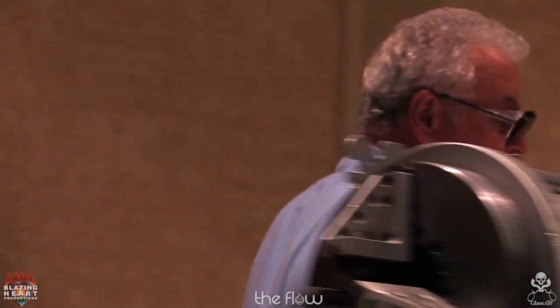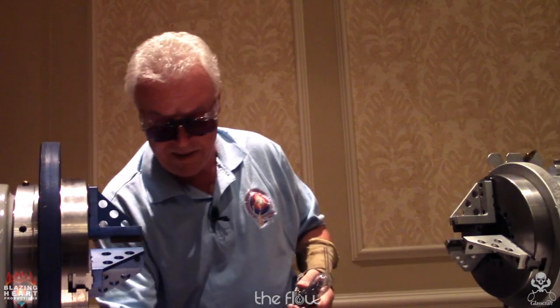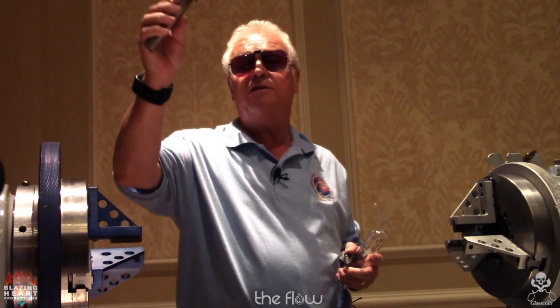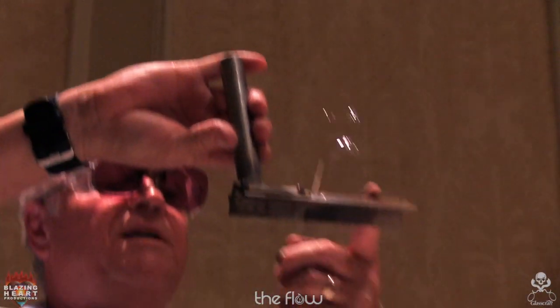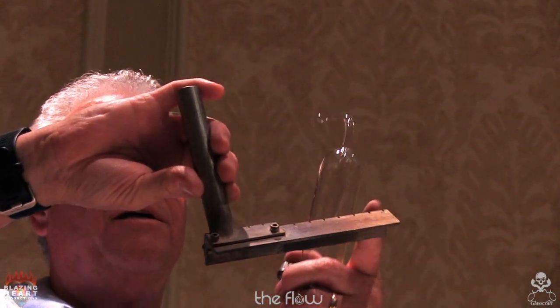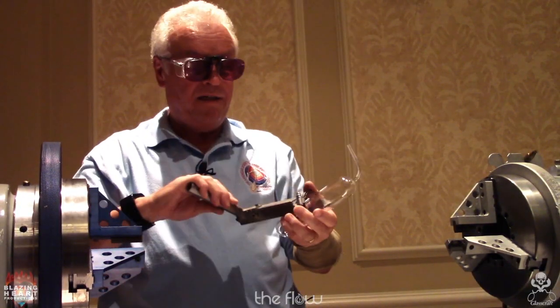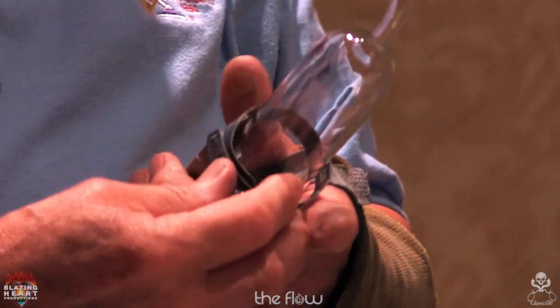All right, I have another holder I use for a lot of quartz work. This is not quartz, but this is a piece of angle iron. It's stainless, doesn't have to be stainless. It's welded 90 degrees. It's got some teeth in here, some grooves. I used to use baling wire to tie my glass on. Found that the radiator hose clamps work really good.